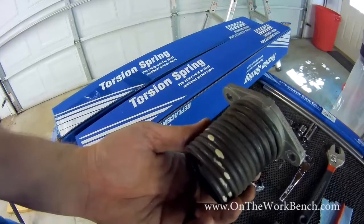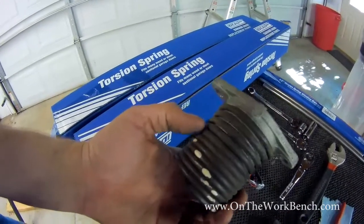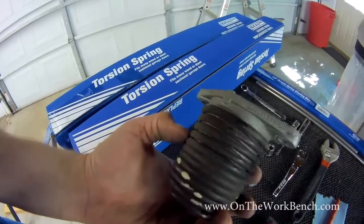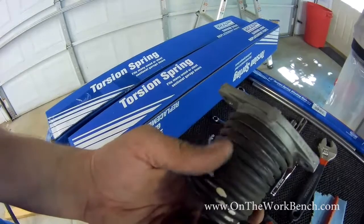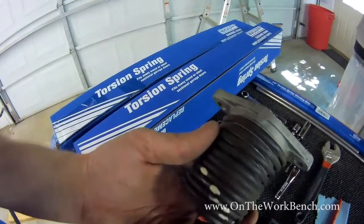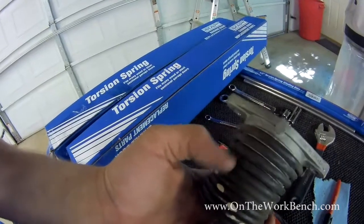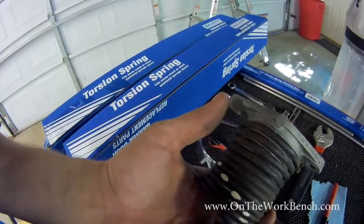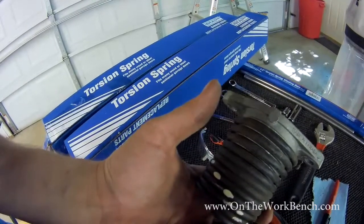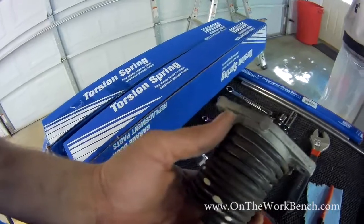And so in my case here, I need what's known as a white spring. These are all color-coded based on the national standards. The spring here, my old one's made in Canada. You'll see some springs are black, and other springs are more of a chrome or a galvanized finish. Both will work just fine. The black ones supposedly have a longer life cycle, but in my experience, I'm not sure that's necessarily true, because a lot of it depends on how much you actually open and close the door and keeping track of that.